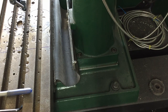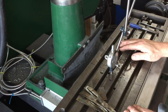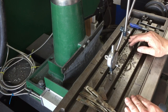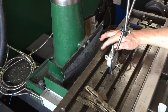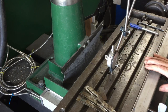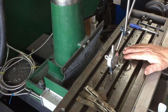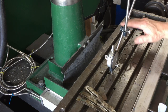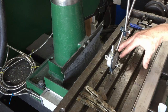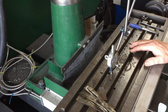The next step is to work out the Y axis. On the X axis we were hinging on the center line, but we can't do that on the Y axis because we're way off center. The approach will be to find a point on the outer edge at both the front and back of the table and go from there. The center of the chuck is in the center of the table, so this will work, but I won't get a clean number like the 1.2mm figure - it'll take a bit more time and effort.